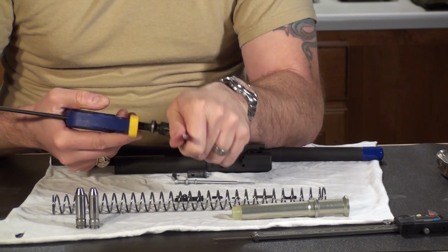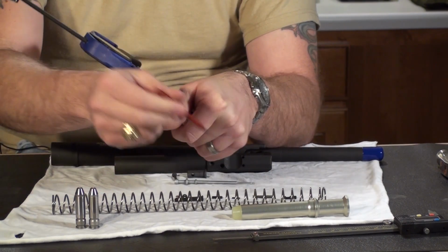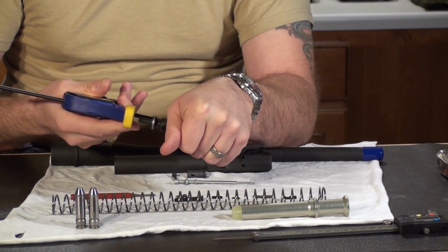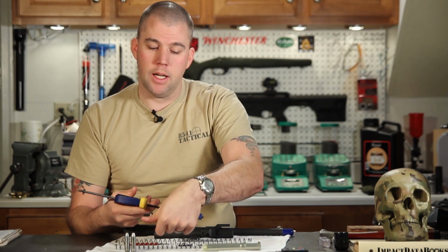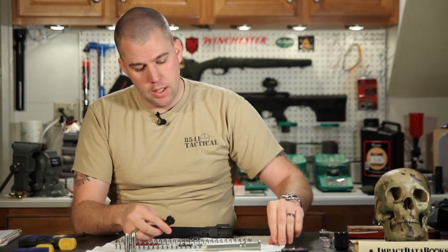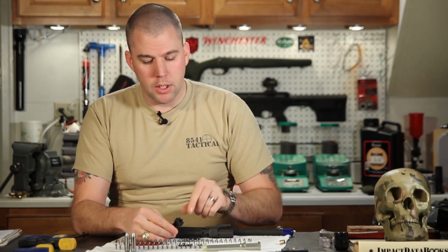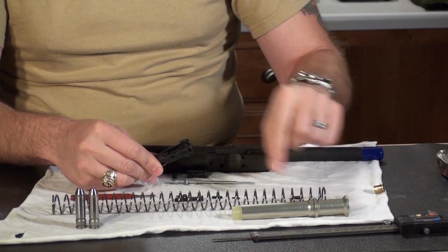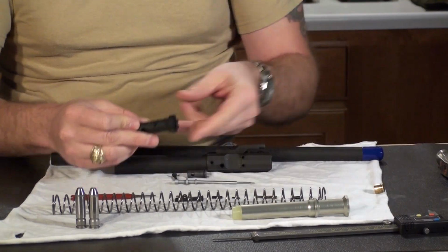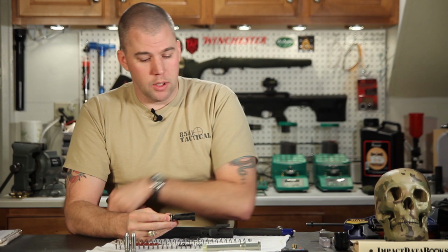Just wrap your hand around the end of the bolt, release the punch, and then release pressure on the bolt. And that spring pressure will push the case head out just a little bit, but it won't go shooting out if you release pressure slowly, because the ejector will only extend out about that far. So you can gently release the pressure, then pull out your plunger and dump out your ejector spring. And for a couple of bucks, it's a real easy setup.